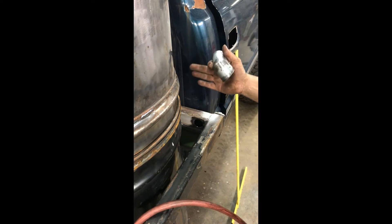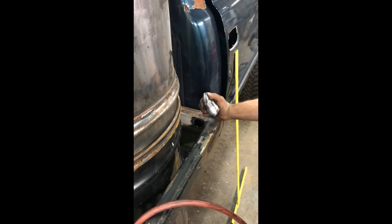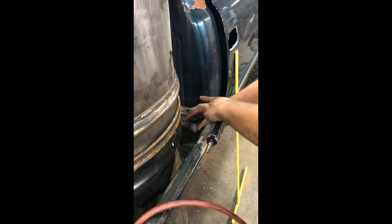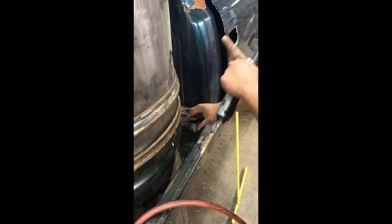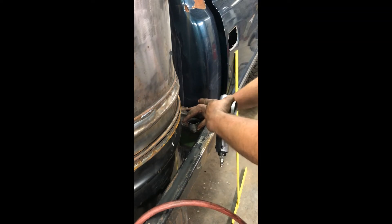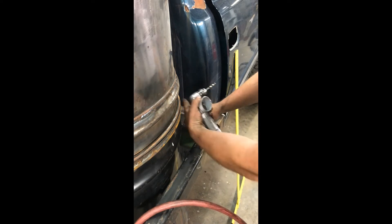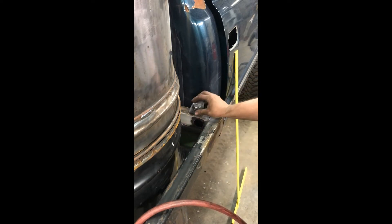Now, that would seem stupid because then the hopper is locked onto the bed and you can't pull the fire tube or anything out. But this is going to get cut in half probably somewhere about right here. And once it's cut, the hopper can be removed and there will be a quick coupler that goes on right here — either a Fernco coupler or a piece of silicone pipe and a couple of hose clamps — and a little heat shield right here to keep the heat away from it. And that will be the drain assembly.